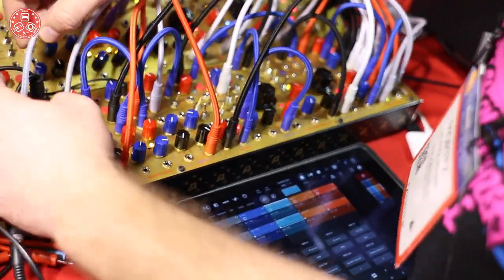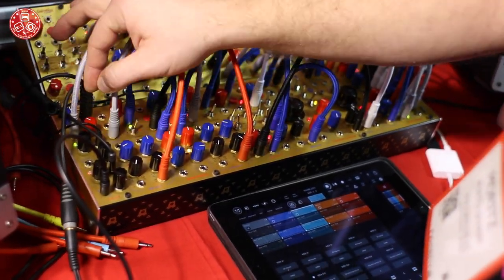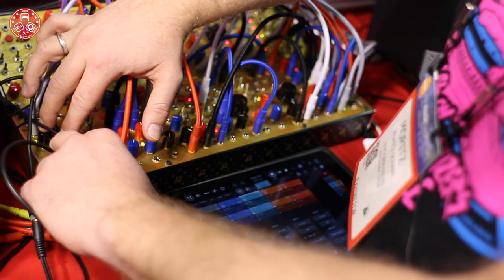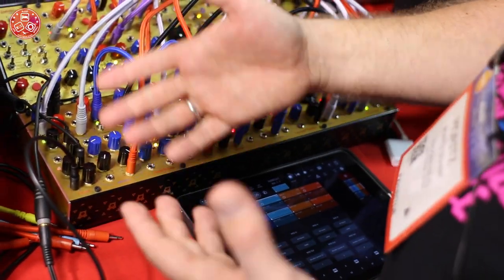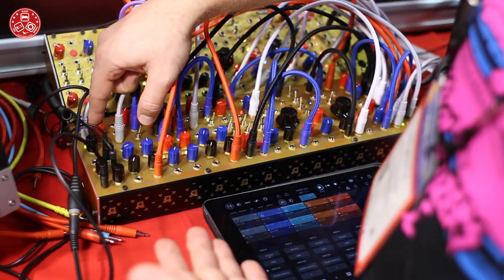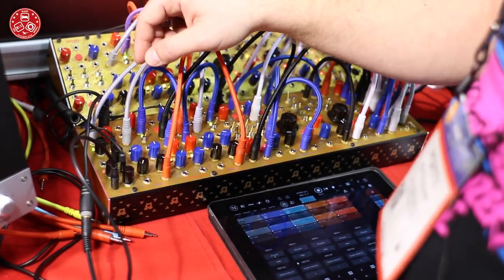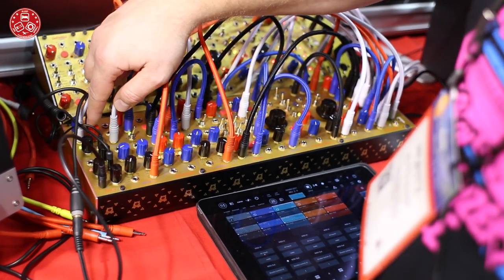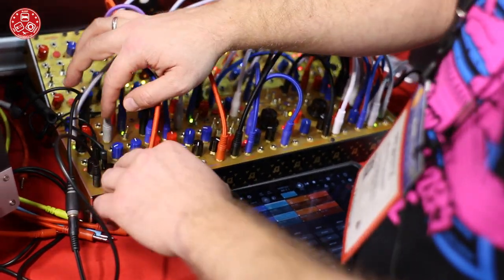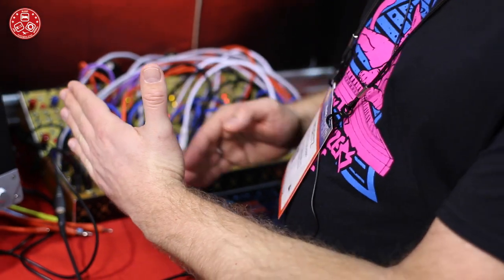The sidechaining works in three different modes. In normal mode, the ducking works with an envelope input. In secondary mode — reached by pressing all four encoders at once — you use audio like a bass drum or snare for sidechaining. In the third mode, pressing again for over a second switches to trigger input, where you can press and turn the knob to select the decay applied to each channel, with this knob controlling the sidechain amount.